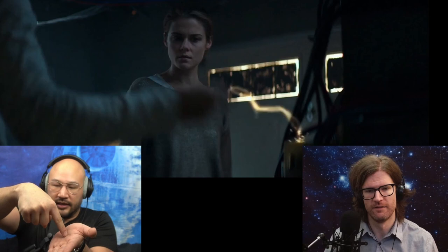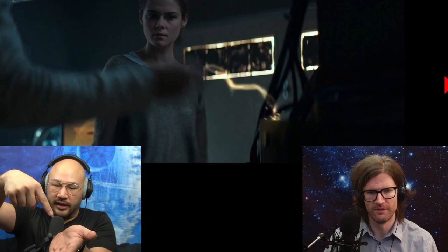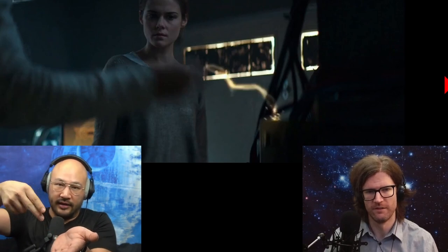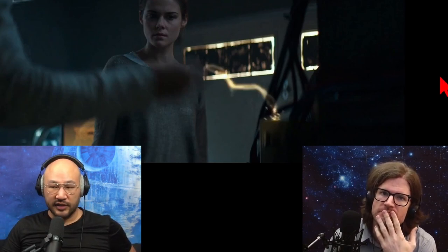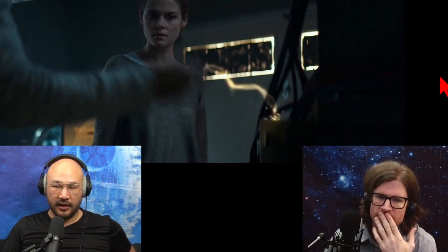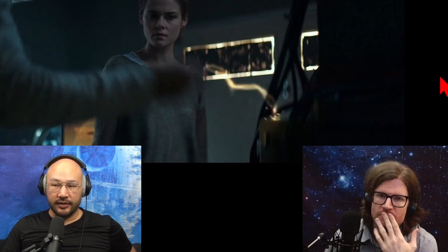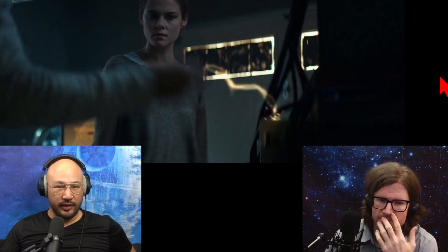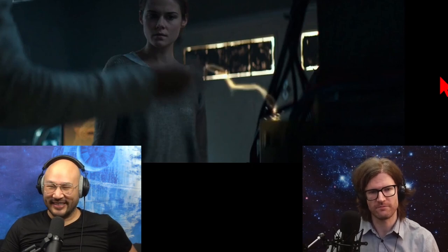And so what I think is happening is once you start the arc, start the weld puddle, then you can pull away your electrode a bit, and you'll be streaming metal ions from your stick down to the work surface. In that case, you don't need 30,000 volts per centimeter anymore, because you've replaced the non-ionized air, with electrons bound to the molecules, with an ionized plasma of electrons and metal ions, literally streaming from your stick down to your workpiece. So it's maybe okay that this arc is much longer than we predicted, because he's changing the composition of the gas with little bits of the screwdriver down to the arc.